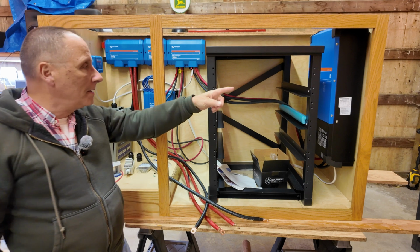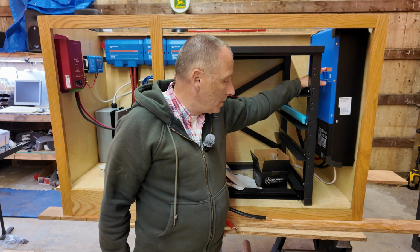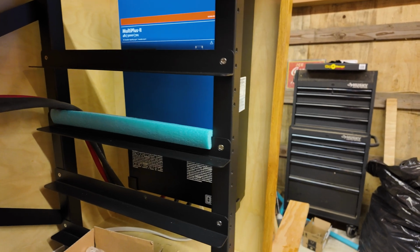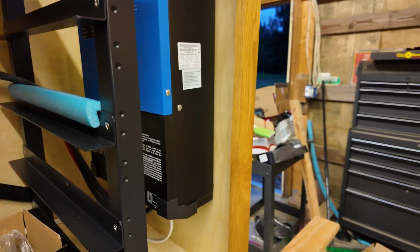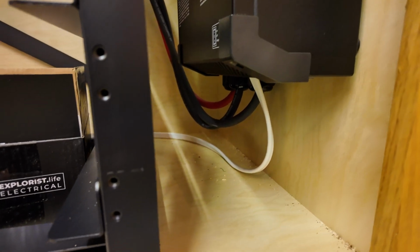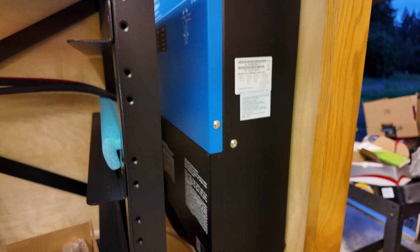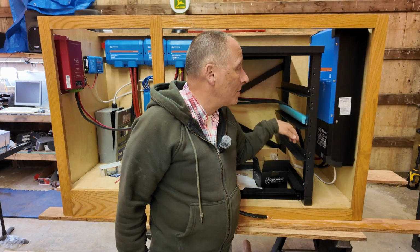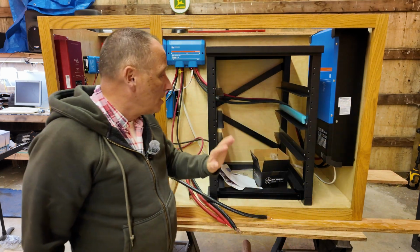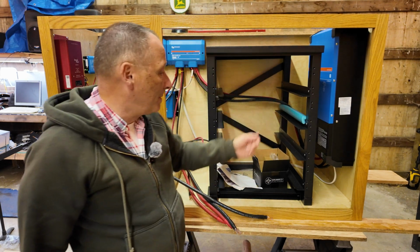All right, we'll start off on that side, your right, with the inverter, which is right here. This is what turns our DC power from batteries into AC power for all kinds of stuff. And this inverter will maintain 5,000 watts of output and spike higher on an occasional basis. And it is firmly attached to our cabinet. It is bolted in to this 3/4 inch backboard, ready to go. And there's already cabling going to it to provide it with the power from the batteries.